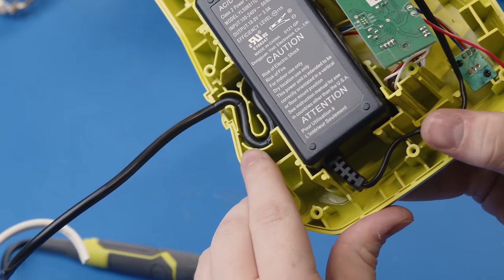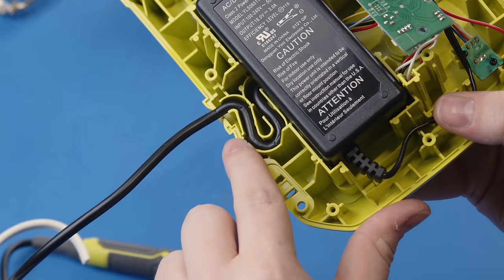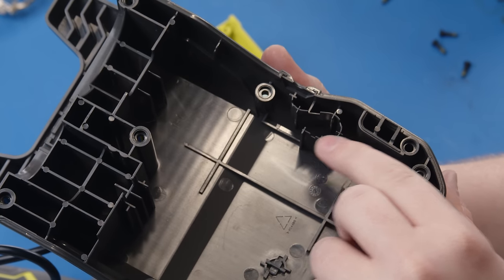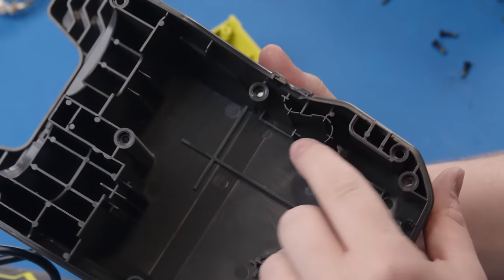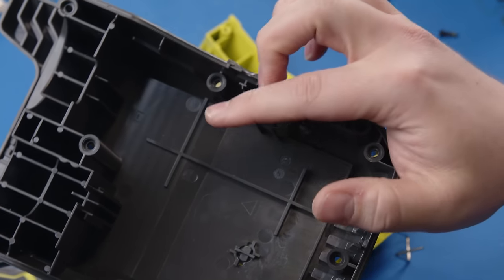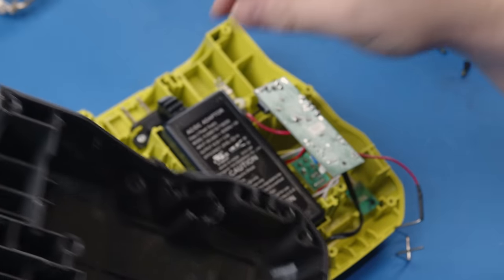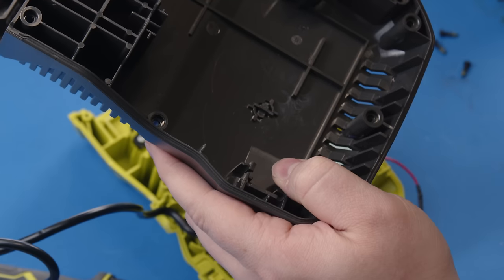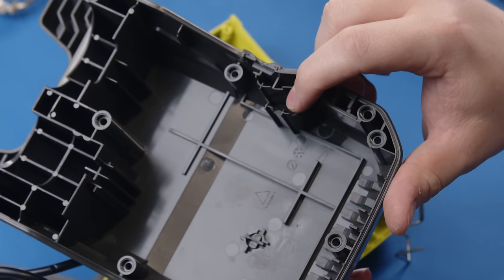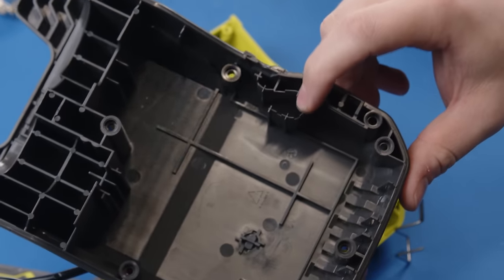That said, if you look closely here, you can see there's these little sort of T-shaped impressions in the cable jacket. And that's because on the mating half, this is what holds that cable indexed into the slot. It's these really thin partitions, really sharp corners on them. These are kind of eaten into the cable. And I think there's a few scenarios where if you had enough vibration on this cable, you might actually be able to get those to slowly eat their way through the jacket. So I wish they'd made these thicker, like these baffles up here. Not really sure why they couldn't have done that.